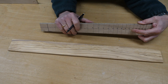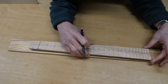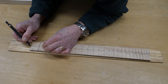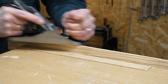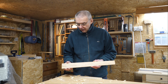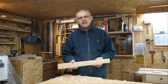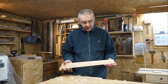I'd rather like this side of the olive — I don't really want this different brown colour. I've got a bit of snipe there so I'm going to move it over. This template goes to 24 frets so I'll do the whole lot, but obviously I'm not going to use 24 frets, it's doing 22. I've roughly shaped the fretboard and planed it down — it needs to go a little narrower because of the binding. If you sand olive you've got to be really careful because the dust is an irritant, so I need gloves and all my equipment on.